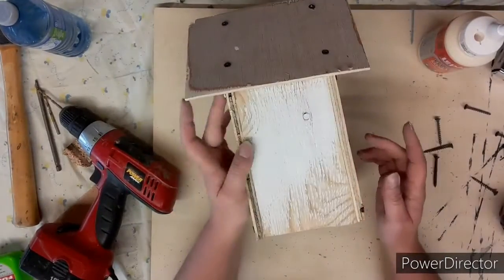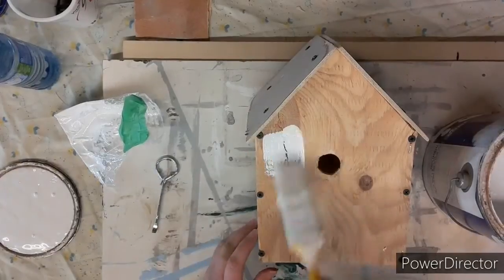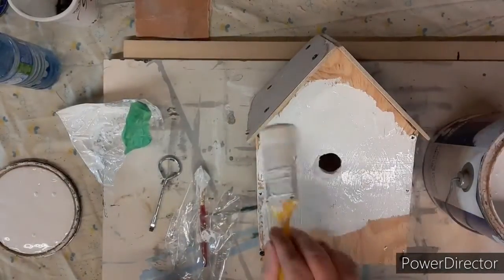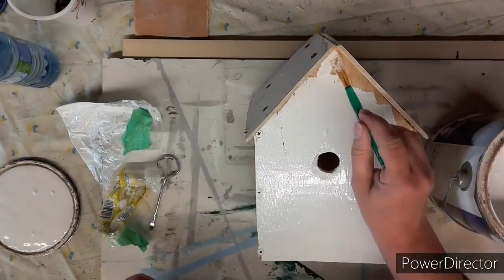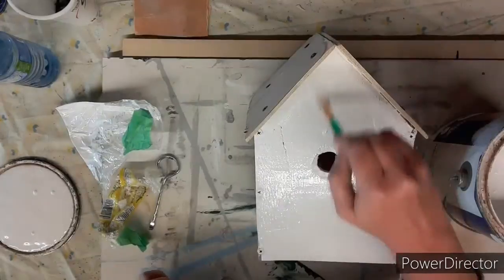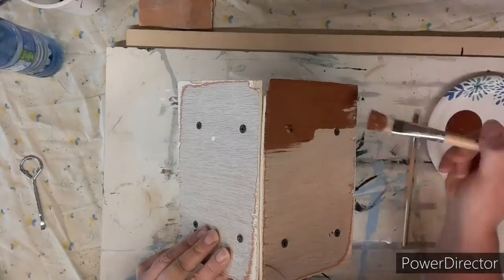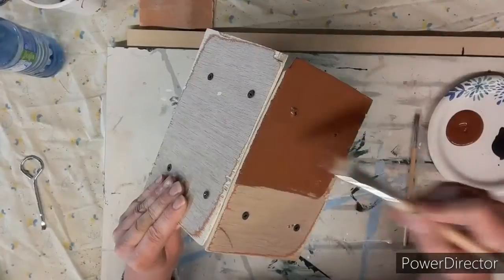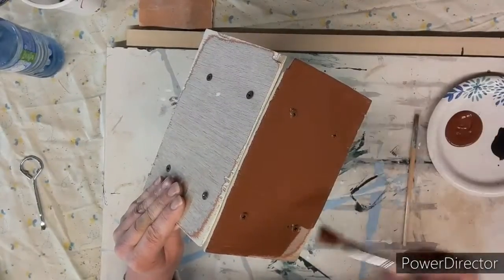Now it's time to paint. Checking it all over making sure everything is good. My brush is wrapped up in a plastic bag — if your paintbrush is wet enough, just wrap it tightly in a bag or a latex glove to keep it soft and wet so you can continue reusing it, especially if you're working with the same paint all the time. It saves you from having to wash the brush constantly. I'm painting the roof brown; the white was just a base coat. The brown is so if color shows through what we put on next it'll match rather than showing white.